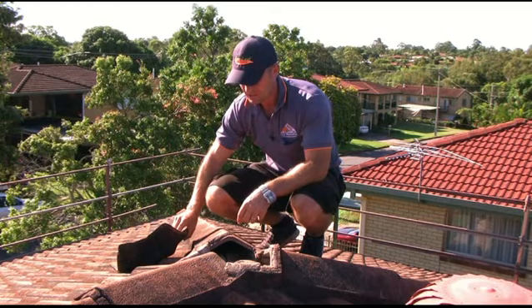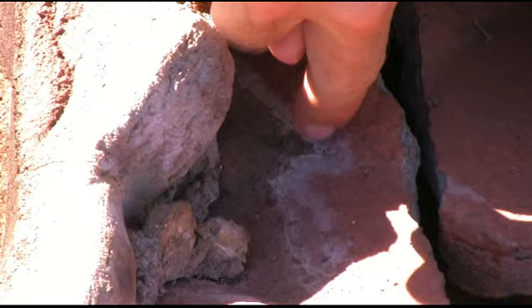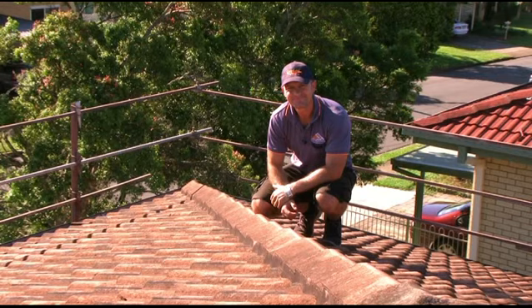The bedding is this stuff here. So if water does get into the cracks in the pointing and bedding, it can actually leak inside your ceiling. Just have a look at this roof, where you can see this white mark — that's evidence that water has been getting in.